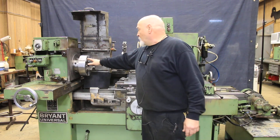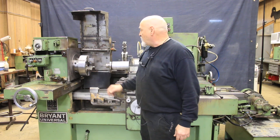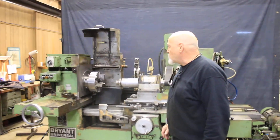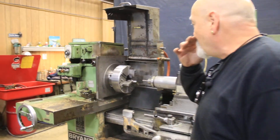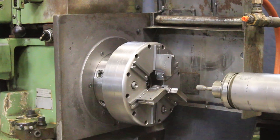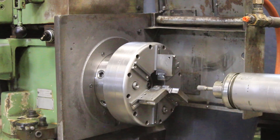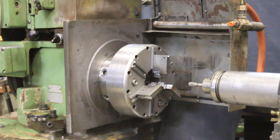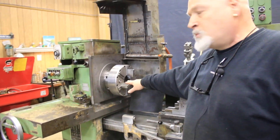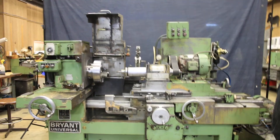We have a W.A. Woodward diaphragm chuck here with six jaws. This is a very expensive chuck, being made today by a company called Forkardt, which is a division of Hardinge Company. Very high precision, very high tolerance — a really nice item. With the machine comes a lot of jaws for this; most of them are custom made and people would make their own for their particular jobs.